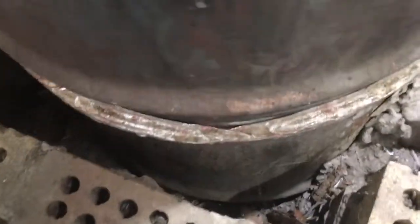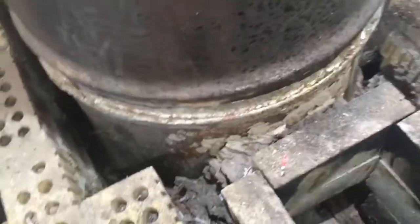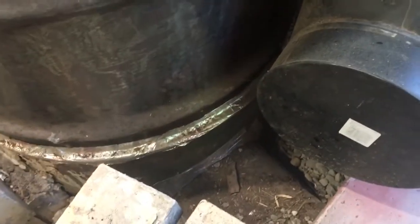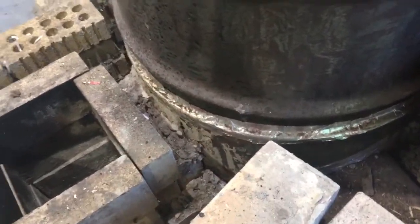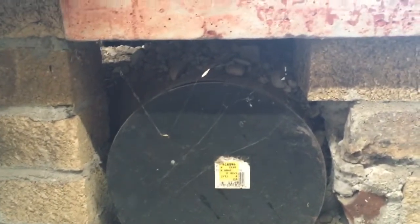When I originally built it I slipped it all together, but that quickly failed after putting logs in and out, so I've had this running as a dry fit for two seasons — it did well, but there are certainly a lot of leaks. Around the bell at the bottom it's also open. I cobbed it into the bottom but that seal has failed, and I do get a leak there at cold startup — it'll puff out for a second or two as the draw gets established. The gravel didn't interface well — it's been slouching, and occasionally a piece of gravel hits the floor. There have also been some mice up in there.